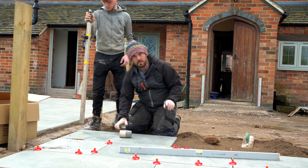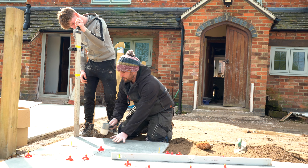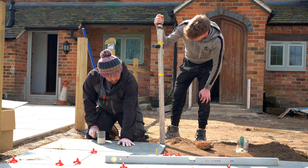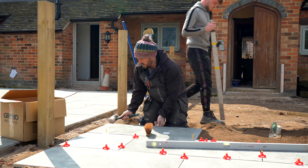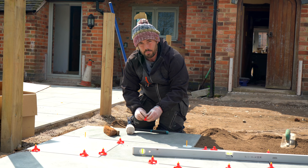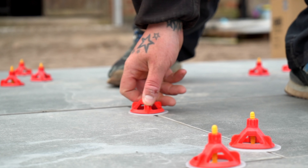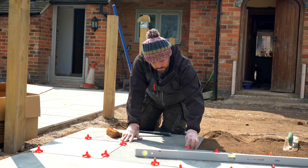You'll notice I didn't let Morgan get me down to zero on this corner, because there's going to be movement as we adjust this corner. What we don't want to do is get that perfect and then knock it about and find ourselves low. Once I've got the zeroes, all I'm doing is pushing the slab in, making sure it's nice and tight. Keep sweeping it off if you're getting any screed on it. Then we'll clamp it down using our spinners. These are designed not to pull the slab down, but if it needs raising any, it will pull it up. So always check your levels again, making sure the edges are flush. We'll do one final check on the outside edge — hitting zero. Then all we do is just repeat the process again and again.